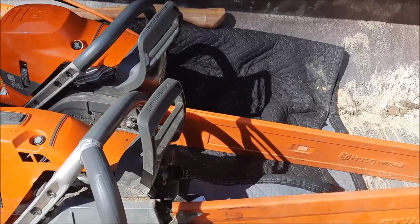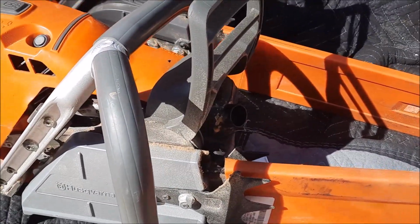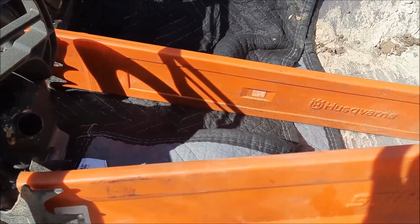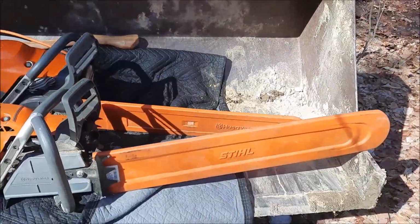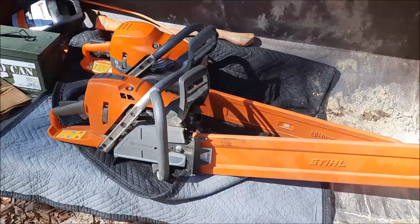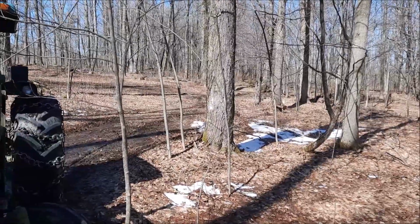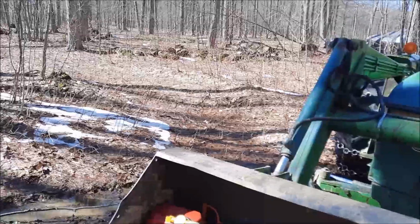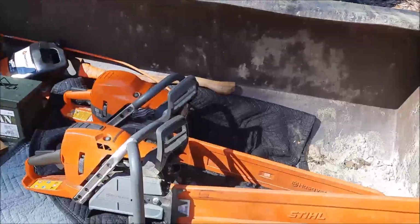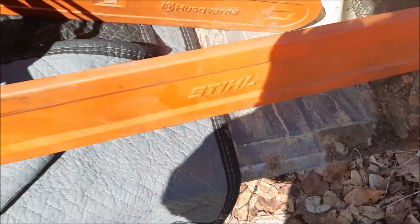When the place you cut's back in here, and you need those big bucking spikes if you're out west and you're cutting out in here somewhere, you need that leverage in order to get enough force to do anything. So I understand why, but with a tree 20 inches, 24 inches, it's not going to hurt you. But when you get down into the 15 to 18 inch trees, it's just going to bind up, because now the cutting force is right in here, not out in here where you need the leverage.